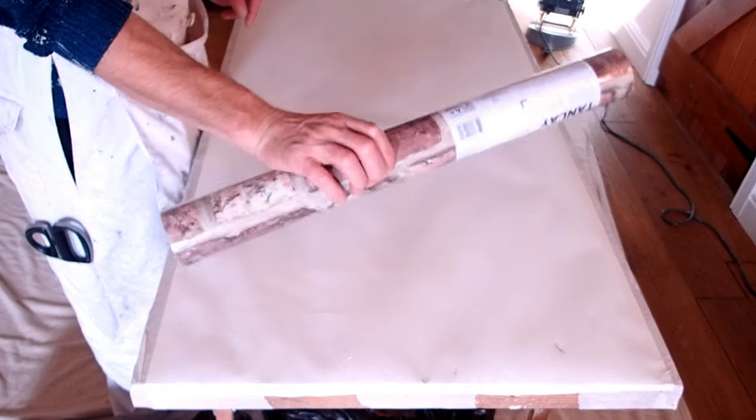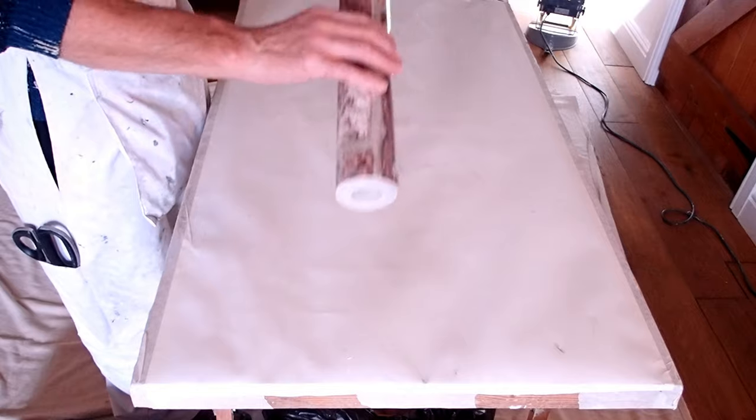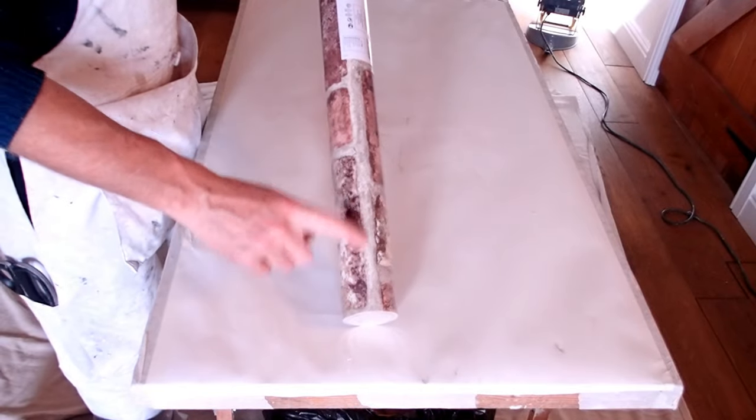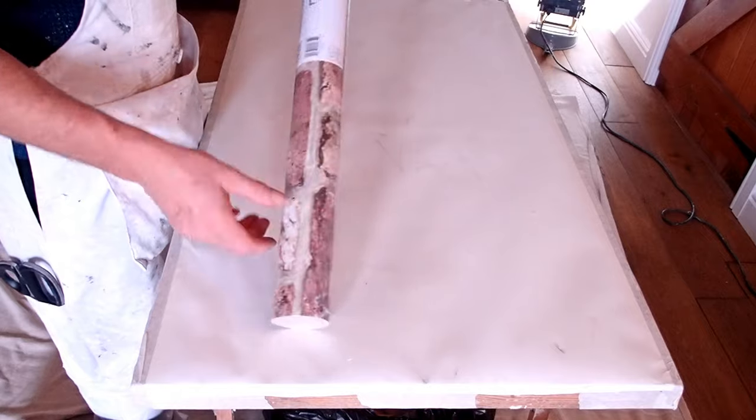So I'm gonna finish stripping this off, wipe round the edges with a cloth, allow it to dry, and then give it a light sand, and it's ready to paper really, because I sealed it last time. This is the paper that I chose, Tanlay. Now, it's a brick effect. The only problem is the cement line's the wrong colour, but you can't have everything, can you?